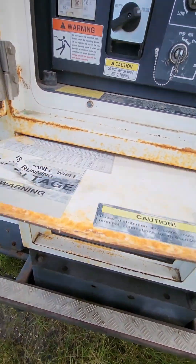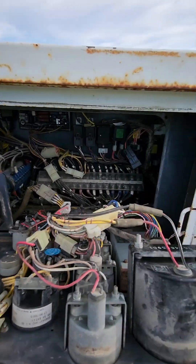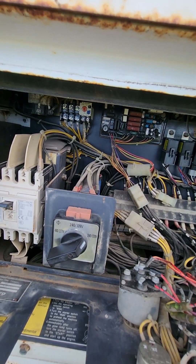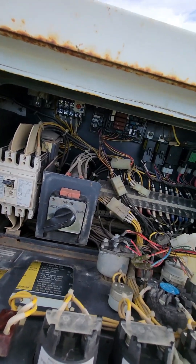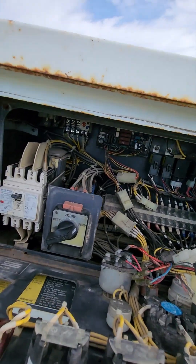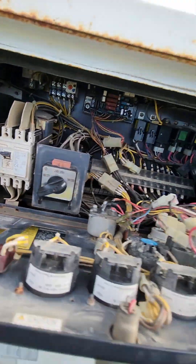So what we're going to do now is open this up and see if there are any AC fuses that might be blown. Now, to see all of this stuff in here — you don't really need any of that to make the generator put out power. That's just extra bells and whistles put in by the manufacturer. I don't see any fuses besides these DC fuses, so it shouldn't be an issue with a line fuse blown. Let's check out the inside of the generator.